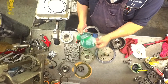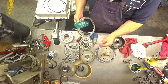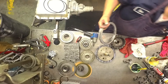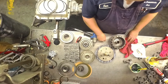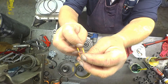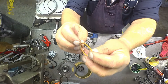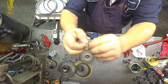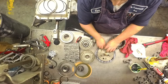This little thing right here is my normal lip seal tool — it's just a Snap-on drawer lock tool. That's what I normally use, but on these I use this. On your pump rings, see how they've got the bevel there to it — it goes like that. Put it like that and it's going to lock up and fit a little large, so just give it a little twist. That'll help keep them in there. You can also put some grease on them if you want to.